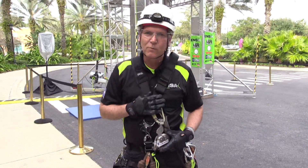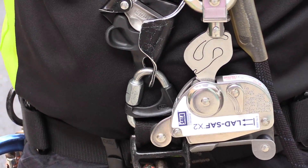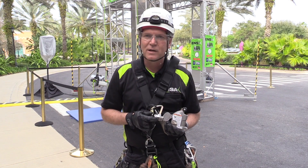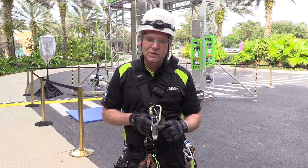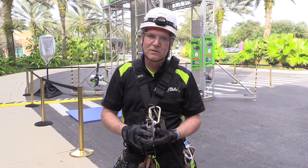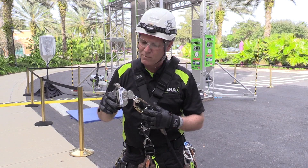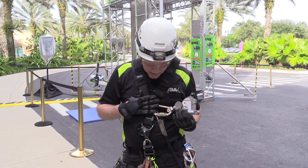On the high connection point — what we call a sternum D-ring — I've got a LadSafe. This is a product from Capital Safety. This happens to be a prototype model that they were showing us today, but this is the new model that's going to be hitting the market in the next few months. This attaches to the cable that runs up and down the ladder, so that as you're climbing, the cable runs right through here and you're never going to have more than a very short 18-inch maximum drop. This is going to be running up and down the cable for you as you climb. All about safety.